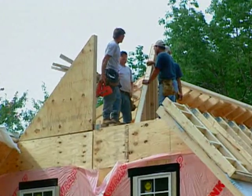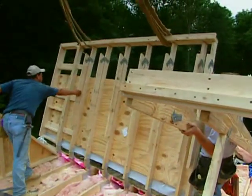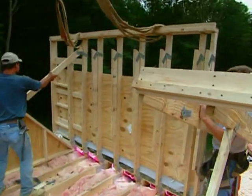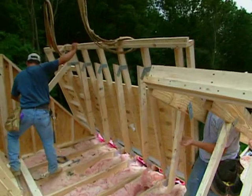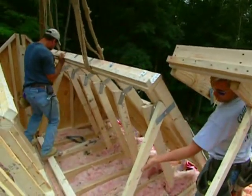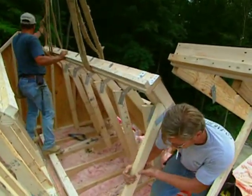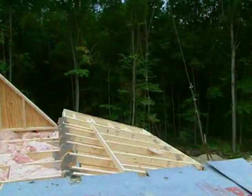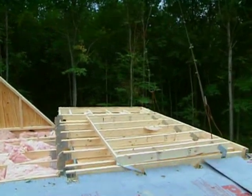All right. Yeah, Bob, again, if you remember, these roof sections were built in the plant, and at that time we pointed out the hinge system. It's a double folding hinge, so what it does is it allows the roof to pivot in two positions, and the roof actually, as you can see, it lays down flat. And again, these are things that are done for our industry to help provide the opportunity for the roof system to be below shipping height.